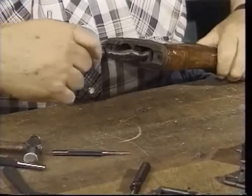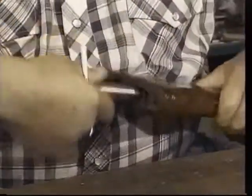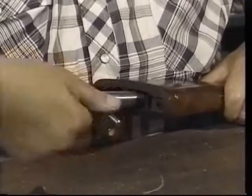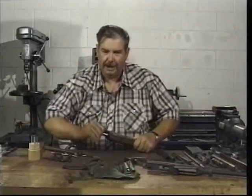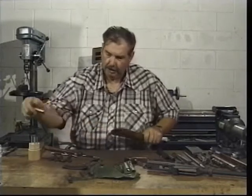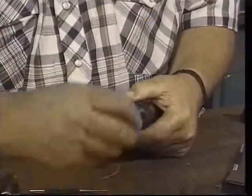Now we feed the spring into the shaft, into the lower, get a couple of good turns on it. Okay, and then just tighten it down. Here again, when you're bringing it up tight, it does not have to be. You've got short handles on it. You don't need to put a cheater or anything. Okay, that's assembled.